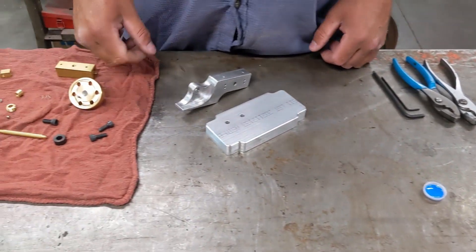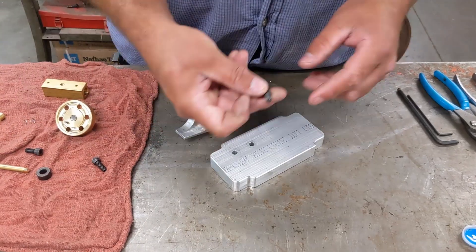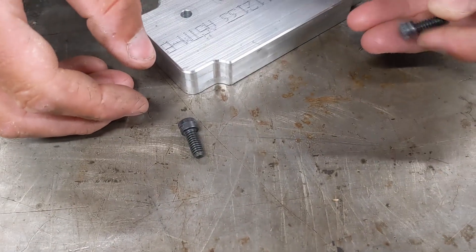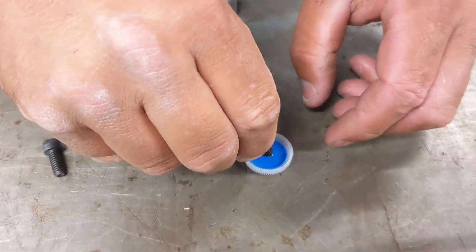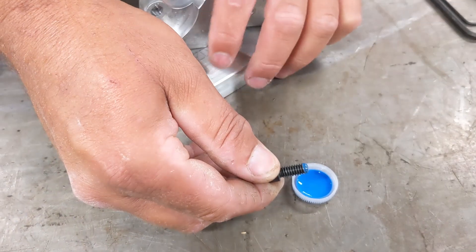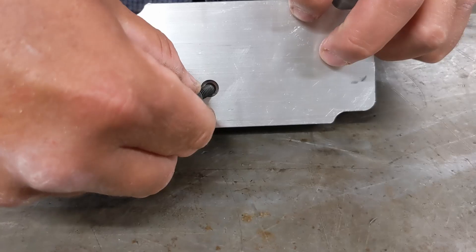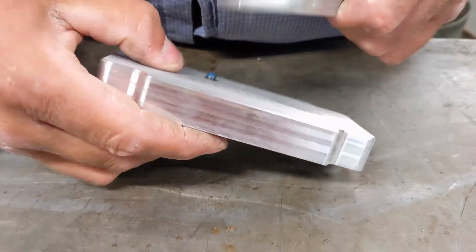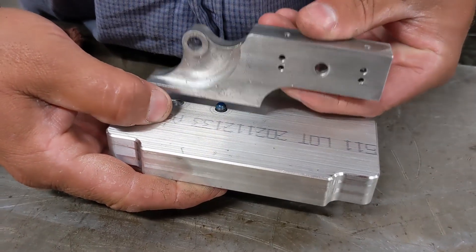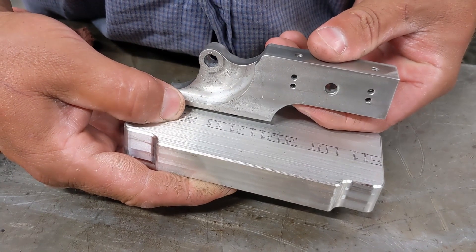To put the engine together, you'll use two of these screws here. They're allen head socket head cap screws, and I'm going to put a dab of Loctite on them — just dip it in there, it doesn't take very much — and then they'll go through the base. I'm going to go up through the base and into here, and this is offset like so. It'll end up like this when it's done. So now I'm going to put both those screws in and tighten that up.